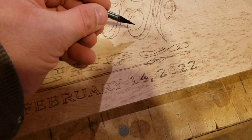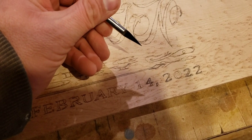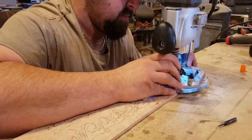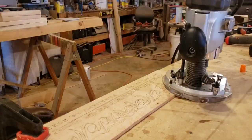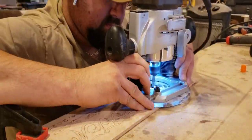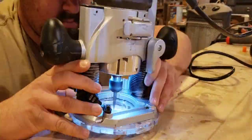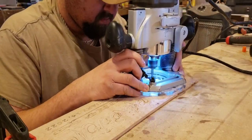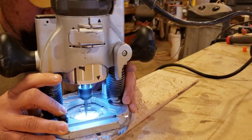You can see exactly how tedious this piece is. It ended up taking me about an hour and a half, maybe two hours, and I took a few breaks to stand up and stretch. Here I am engraving the plaque. Basically, what I do is go around the outside line with my router to trim everything out, and then I come back in and hog out the meat with a different bit — which is one of the reasons I want to get another router. That way I can leave two set up with my main bits for engraving and not have to keep switching back and forth.